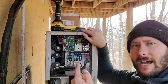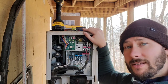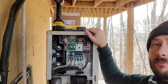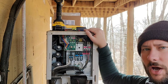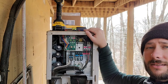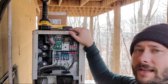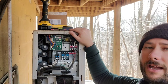I got the new PCB on, I've got a new sensor, and when I started the unit up I've got an error code E201, which means the number of indoor units is mismatched. So what I need to do is enter the pipe check operation. I need to make sure the dial is set for the amount of indoor units that I have. It's very easy to get over — all you have to do is set the dial. If you have two units set it to two, if you have three units set it to three. So let's go ahead and do a pipe check, which is K1. You hit K1 and you're going to enter the test operation — you're going to pipe check — and it's going to figure out how many units we have hooked up. It's an auto address feature.